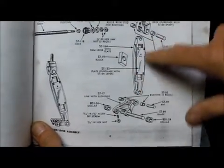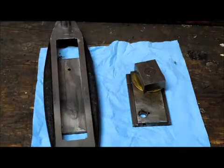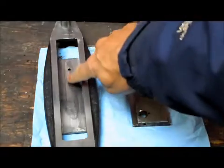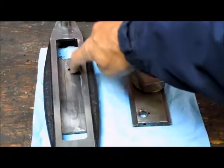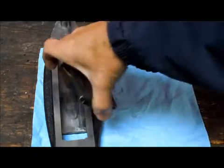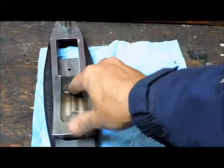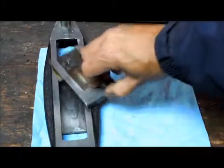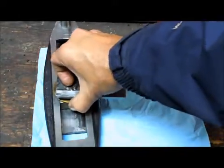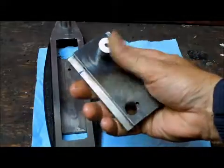So this ram lever here, it's got a plate on it. And I pulled it apart — this plate, this backside, this plate is all scored. This block fits inside of there, and this runs up and down as the crank gear turns, gives you a stroke. I'm not sure — I think this is original, but this looks like some sort of repair — this pin. It was too long and it was digging into this plate.